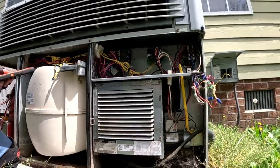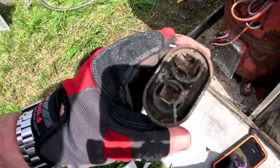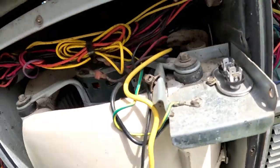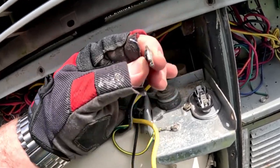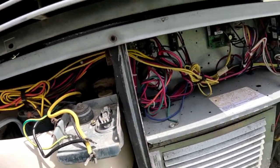So I've got this coil cleaned as good as I'm going to get it cleaned. It was really slammed up, so this probably is related to our superheat issue. I'm hoping that when I get the blower capacitor on, that blower ramps up a little more, and maybe we're going to be okay with the refrigerant charge, and we'll get that relay replaced in the process. So I've got the capacitor replaced. This is the one that came out - it's a 10 reading six and a half. Hopefully between that and the coil, along with swapping the relay, that'll explain my pressures and my superheat being low because we had crappy airflow. I've got to get these wire terminals tightened back up, then get this thing back on and see what the result is on those pressures.